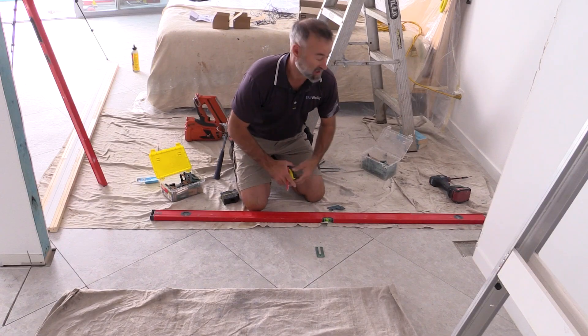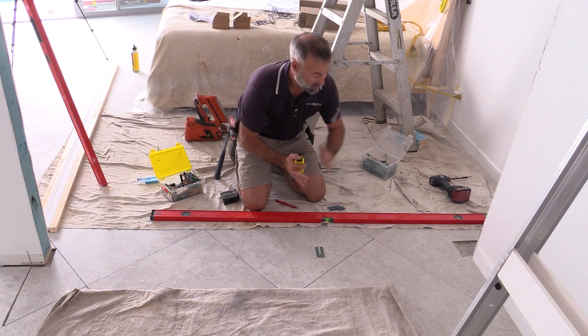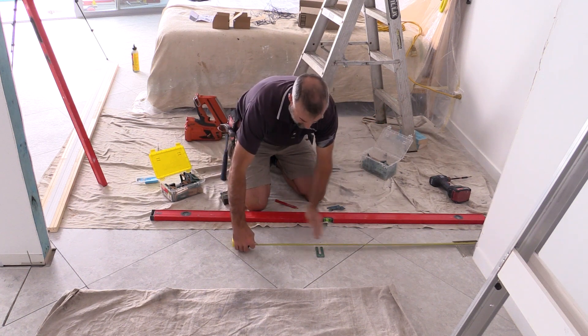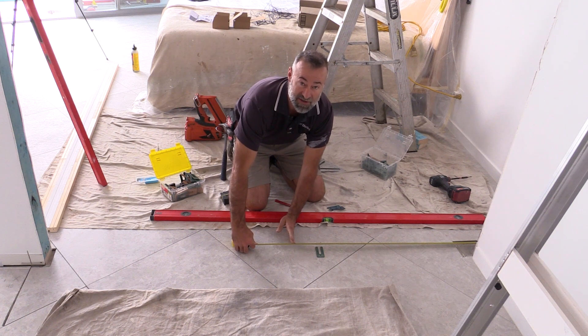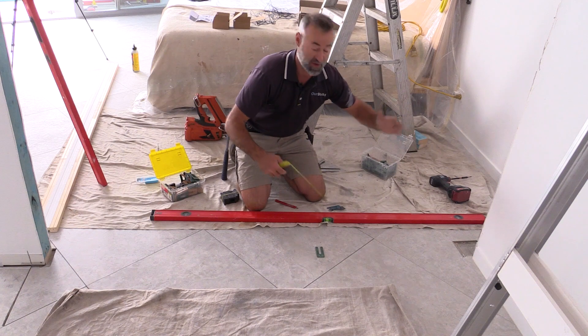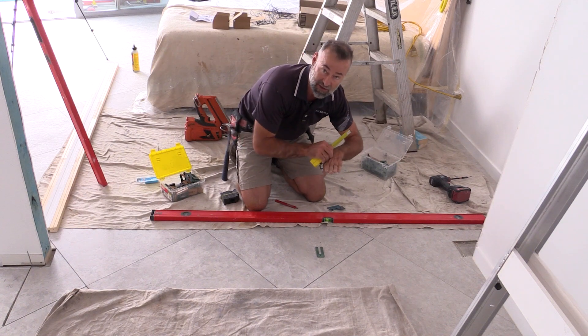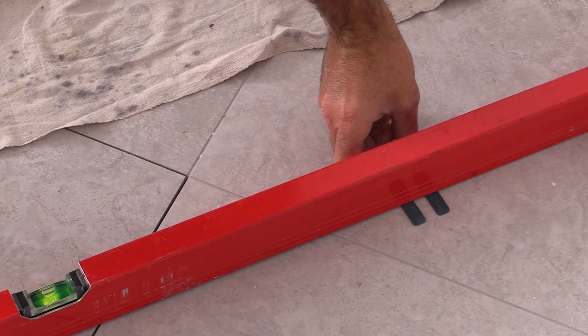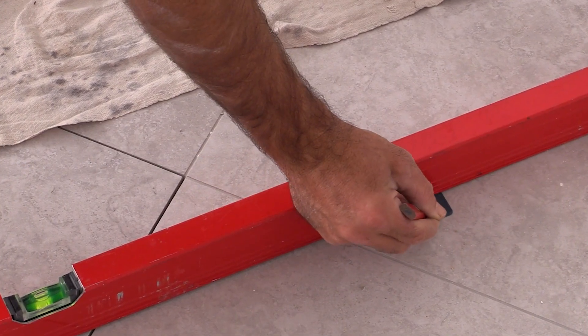Like with the standard cavity door install, I know my unit's sitting on this side here. I want to measure out from my studs basically where the edge of the carcass is going to come to, and then I want to pack that bottom rail so that when I sit this on, it's already sitting perfectly level. Working back, I'm just going to make sure I've got a nice level base and slide my packers through so I know it's going to be nice and solid.